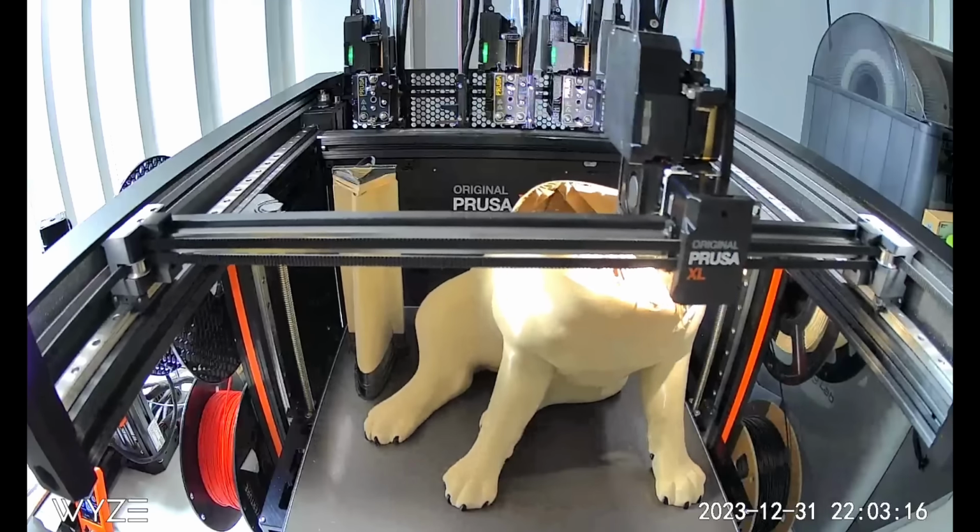So you can see that the temp tower is really beat up and it's kind of cracked where it should have had the red along the top, and along the bottom it's cracked. So at first, when I was just looking at this temp tower, I hadn't looked back at the video yet. I thought it was mainly at the bottom that was the issue, and I couldn't really figure out why the top looked so weird. But of course, then when I looked back, there's a couple issues with the red not printing in the middle, made it kind of hollow right there, and so that kind of started to tip a little bit. And then at the base, it's almost like the filament didn't adhere together. So that is the main reason that the temp tower fell over.